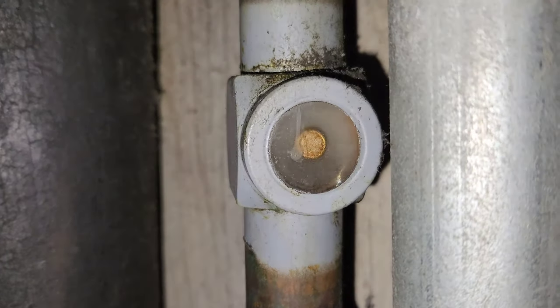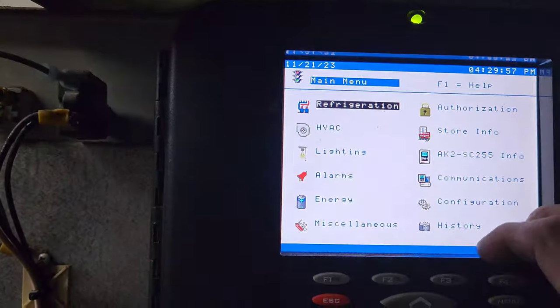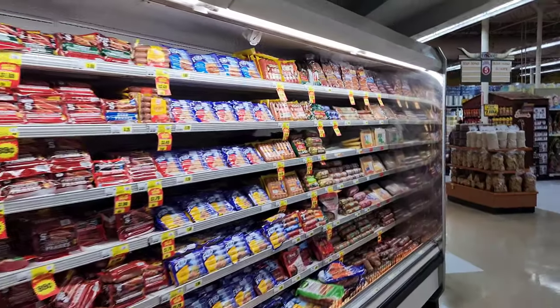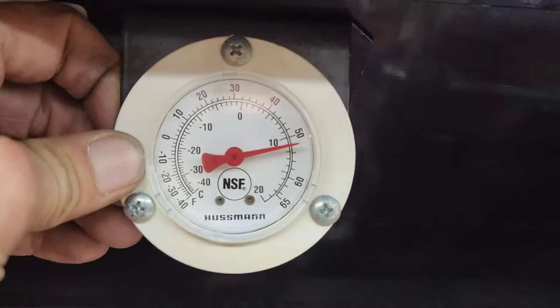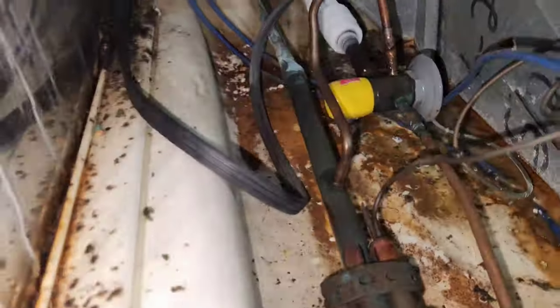So let's add some refrigerant to this thing. Right now we know we've got a pretty good amount of vapor in that liquid line. We know our receiver level gauge up on the roof is pegged out at zero. We know the reading of 69.9 is wrong — that's a bunch of BS. We also know this case, being one of the further ones, is at 40°F, and the one next to it is at 52°F. That's what the frost pattern looks like coming out of the expansion valve.